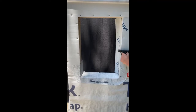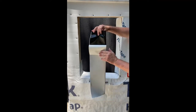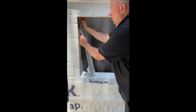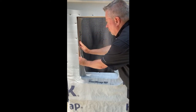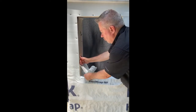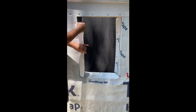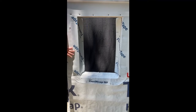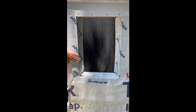After the flashing tape is installed, be sure to firmly roll it onto the window opening. Flash the other side using the 9-inch DuPont flashing tape and the same technique. Be careful to pull directly down and away from the top of the window when removing the release paper — pulling at a 45-degree angle or out to the side will cause the release paper to tear. This method is by far the best way to reduce any chances of wrinkles and bubbles as you attach the flashing to the window opening or wall.